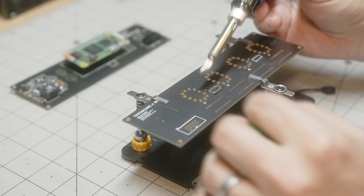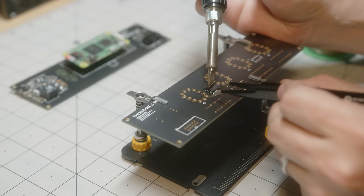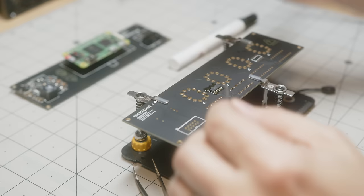These are shift registers, the surface mount versions of the ones that we used on the prototype board before. Now, a little trick to put these on is tack one leg down first, then you can align it to make sure that it's sitting on the pads correctly and that it's flat to the board. After that, if you use a lot of flux, you can use this drag solder technique. If you did it correctly, then none of the pins will be bridged and the solder will adhere only to the legs and the pads themselves, but always check your work afterwards.